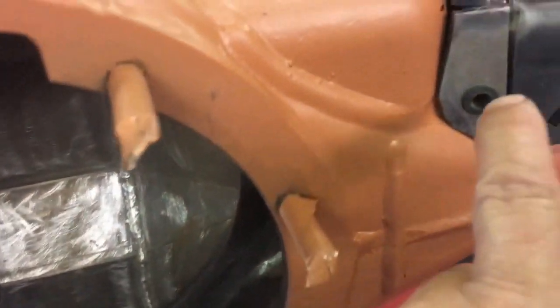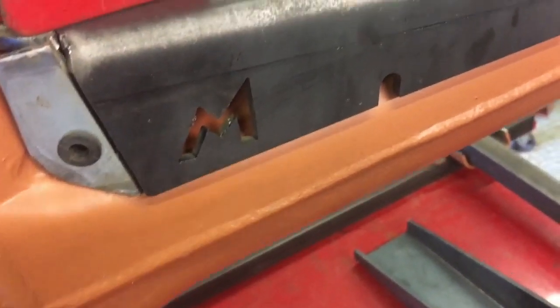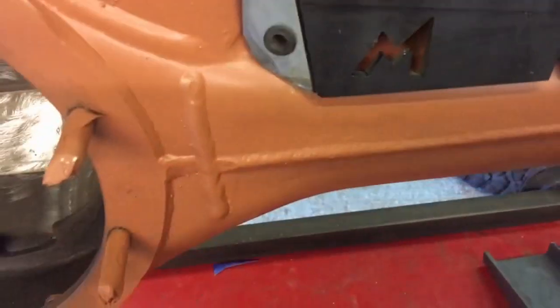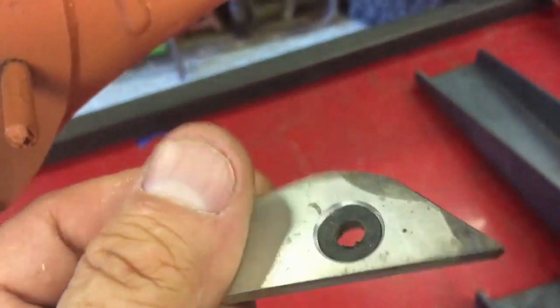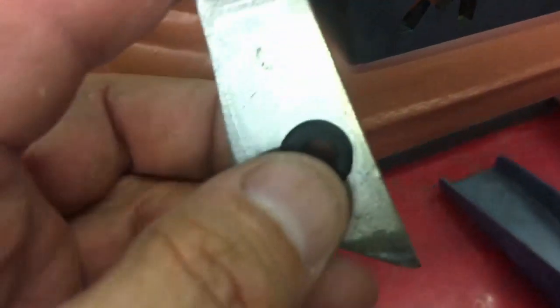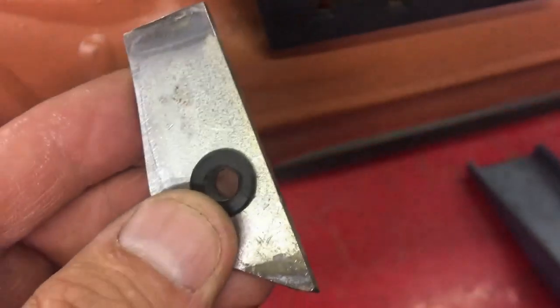On this side this would just be an open gap, so I've made up this plate. You can see I've got a grommet in there and that's where the breather tube is going to come out and go up into the rear arm and into the breather. I'm going to use the Gwyn Lewis kit, and if you use the Gwyn Lewis kit you can also buy a couple of 12mm right angle swivels that go in there, and you can fit the pipe into there with the 12mm. Standard on the TD5 and the Puma axles we've got a knock-in brass thing that can come out. So I've got a grommet in there, and because you can't actually have the grommet in material this thick I milled the back down and recessed it so the grommet sits in. I did the back purely because it just looks tidier.